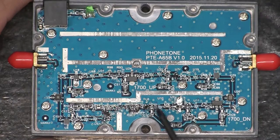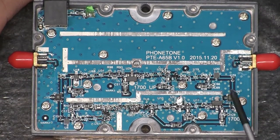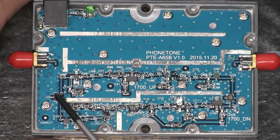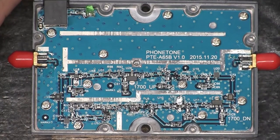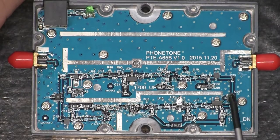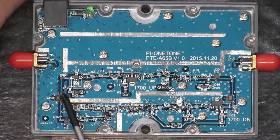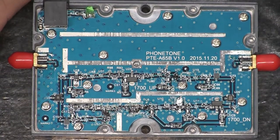This is all microstrip line circuitry as well. These circulators are actually pretty cheap and obviously you can't see it on camera, but it's ever so slightly ferromagnetic — very weak because these are very small circulators, but I can feel it in the screwdriver. It's a dead giveaway because circulators have little tiny ferrites in them to cause the wave to circulate through the cavity.